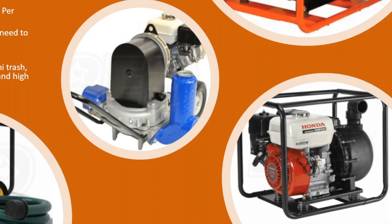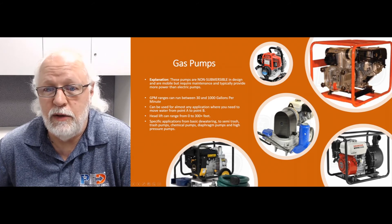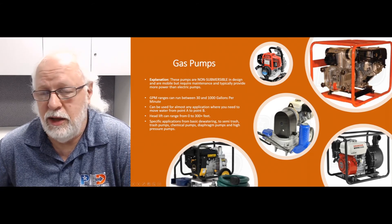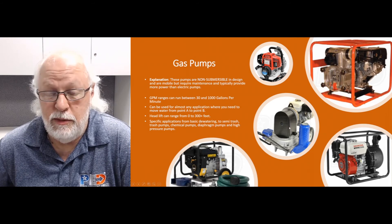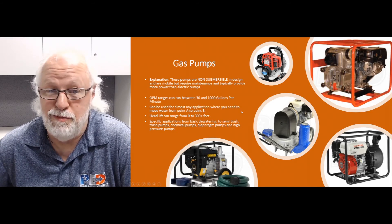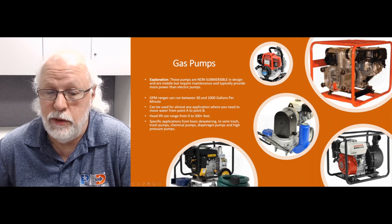The diaphragm pump can handle sludge and heavier material, but you will be limited on head lift and pumping distance. Since you're pumping heavy sludge through a lot of hose, the weight involved restricts you. For sludge or slime applications, you're looking at maybe about 20 feet of total head lift and maybe 50 feet total pumping distance — 75 feet if you're lucky.